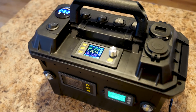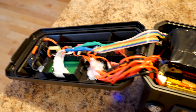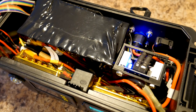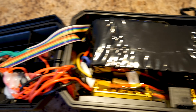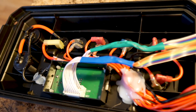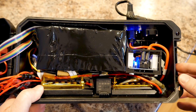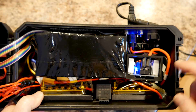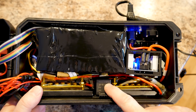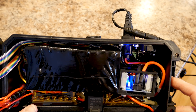The first look at the inside of the power box reveals a very snug fit for all the wires and devices. Major components such as the battery pack, buck converter, relay, power supply, as well as 12 and 24-volt bus bars fit in the bottom and sides of the case. The top of the case contains wiring for the switches and outlets. I directly soldered the USB and 12-volt receptacles to add clearance to close the case. The data cables for the boost-buck converter were also extended to reach the back of the supply board. I designed and printed a cage to help protect the buck converter from touching other wires and components. The 24-volt relay fits perfectly in between the 12-volt bus bars, and the power supply board for the boost-buck regulator fits nicely underneath the SAE port and brushless fan.